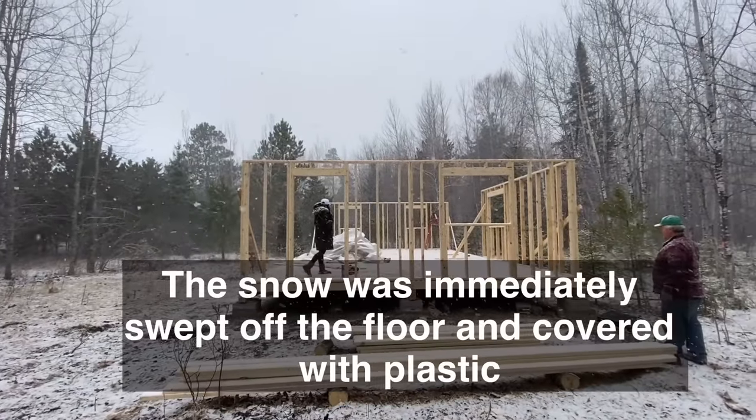See, we nailed a board here, plus with this beam and where the rim joists meet here, so that we're actually nailing into the rim joist, which will tie the rim joist to the studs. So anything we can do to tie everything in to make it stronger, the better. So that's why we're doing that. A lot of people don't do that, but it only makes it stronger.